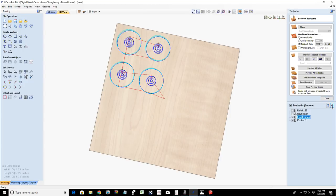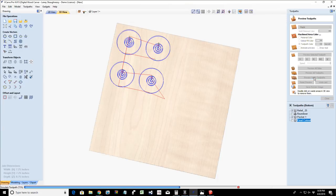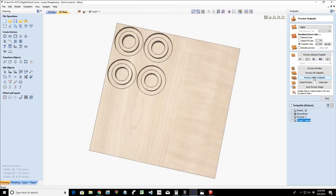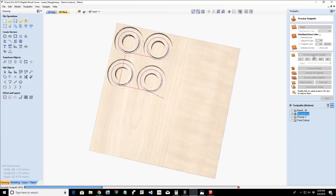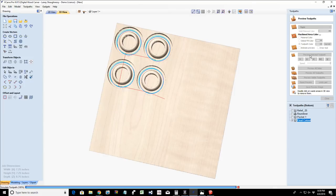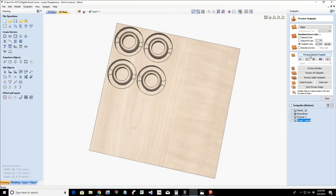And let's move that profile cut there. We're just adding another toolpath. Now, the relief cut and the pocket cut can be saved and run as one toolpath. Not the final profile, that would be a different one. That pocket cut would cut the pocket out. Now you have no center peg to worry about. Then we would run the round over. And then we would do the final cutout on our parts on that side.